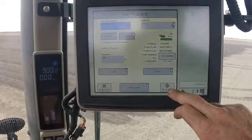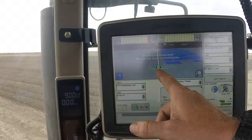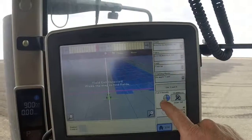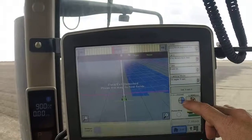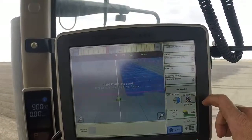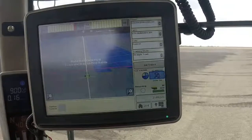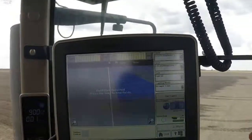We click on the Accept button, and then you'll see the AB lines have turned up on our display. You'll also see this little four-quarter pie icon. Now that we've got an AB line in there, it's half filled in with blue. When you then click on Steering, a third quarter will be added, and then to engage — so that's the auto-steer turned on and ready to be engaged.